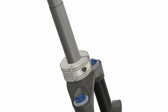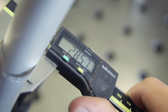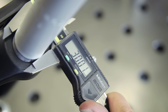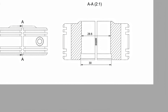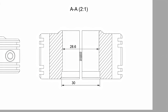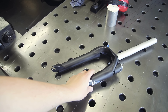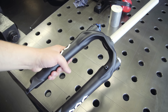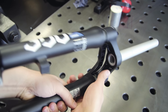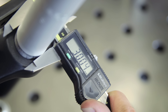The next part involves some problem solving I had to do regarding the fork steerer. The front steering pulley gets clamped onto the steerer, but as I built the bike this turned out to be more complicated than I first thought. In theory a 1-1/8 inch fork steerer has a diameter of 28.6mm at the top and 30mm at the very bottom to fit the crown race seat from the headset. So in an ideal world the steering pulley could just be a straight 28.6mm bore that opens up slightly at the bottom for the crown race seat clearance — but it turns out it was naive to assume it's that simple.